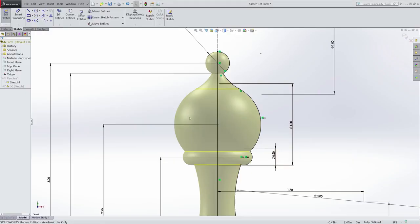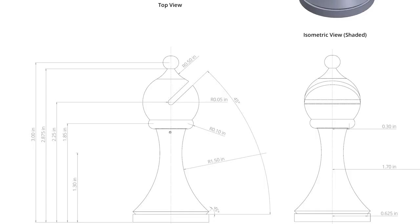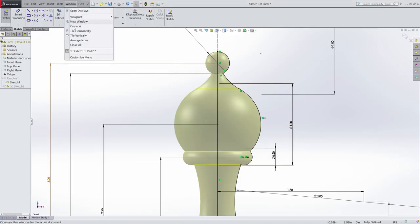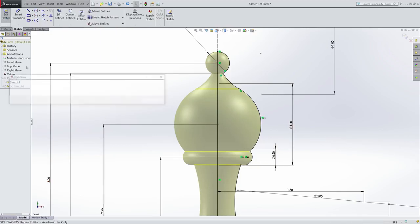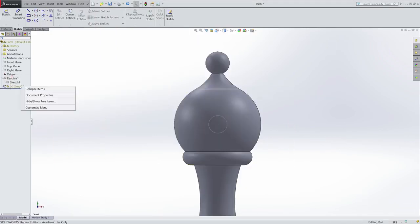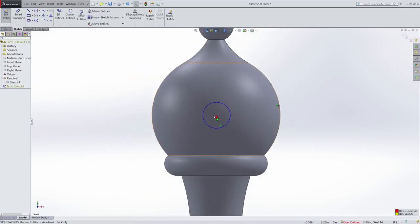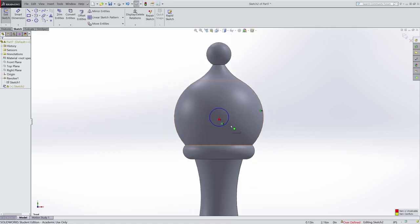So going with concentric circles here is not actually the best way to do that. Let's jump back to the other sketch. I know, it's still broken. I'm trying to prove a point, SolidWorks. Give me a break. Okay, so by defining it to be concentric with this arc, I am now not concentric with this arc. So I have the option of being concentric with either arc, but not both. And neither one of those is going to be vertically aligned. So let's approach this from another angle.